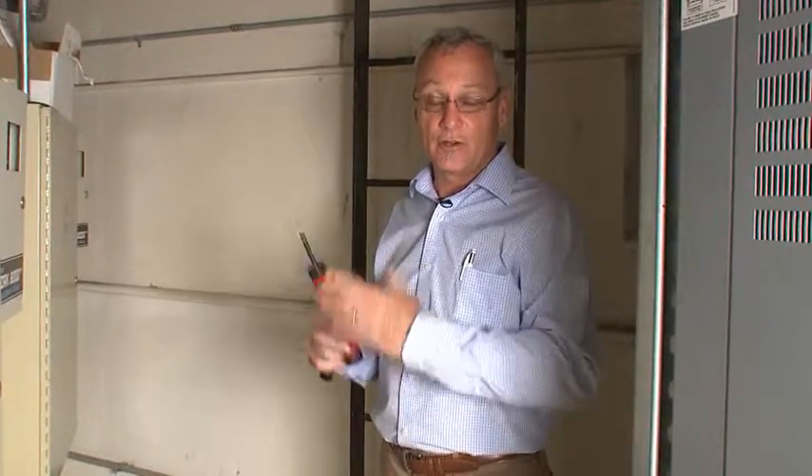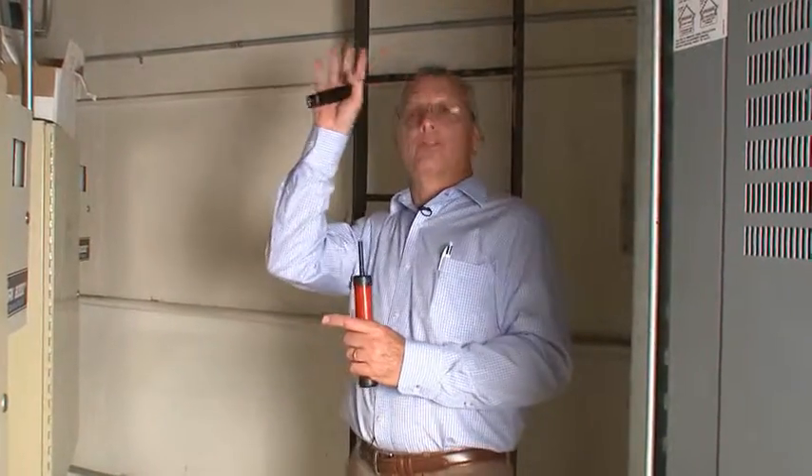Now we're just on the roof at the roof hatch, and now we're actually at the roof hatch below it. I'm going to go up the ladder and test with the smoke pencil to determine where the air leakage points are. We notice there's a bit of cobwebs here, so we know there's some air leakage just from looking at the hatch from down below — so we'll go up and take a look.